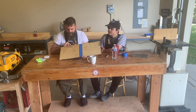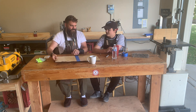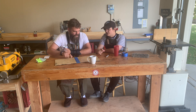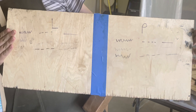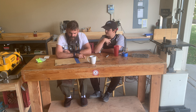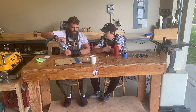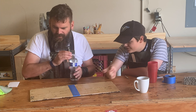We have marked the lacquer and the polyurethane with both the marker and the crayon, with a different design on each, and we're going to go ahead and put on some water. What I can see is that the polyurethane actually prevented the crayon from completely going on — the lacquer side looks darker. The pen on both of them looks about the same, and the marker also looks about the same. I'm putting one cap of water on the poly side and it all bubbles up. It bubbles up on both sides.